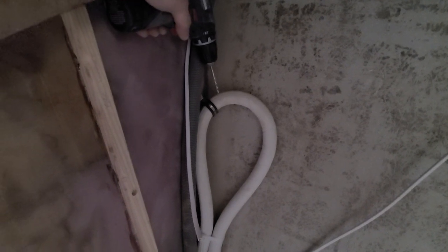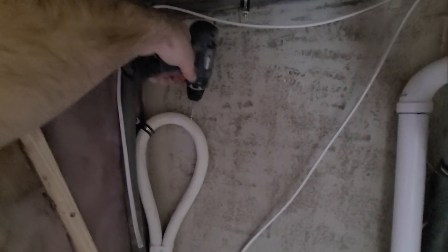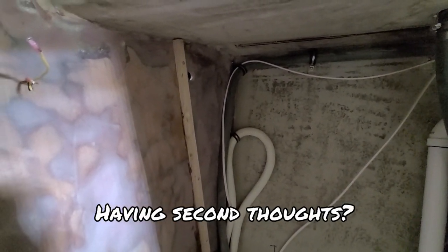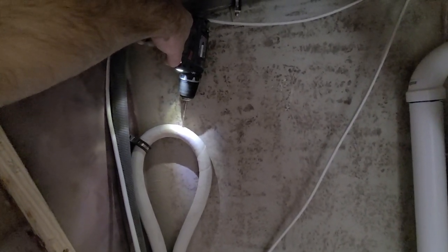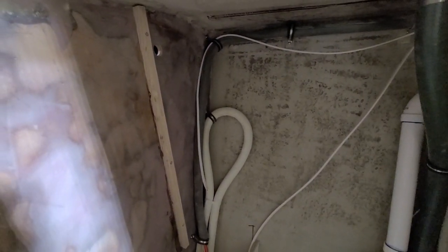We need to drill the hole. I want to make it so I can actually get at it too. Access to it is the most important — what if we need to change the plug at some point? So we'll put it right here. This is a three-sixteenths inch bit, which is as close to five millimeters as I have. The instructions say do a five millimeter or one-eighteenth inch hole, but nothing's one-eighteenth in the United States, and one-eighteenth is not even remotely close to five millimeters — but three-sixteenths is, and that's about the size of this plug.